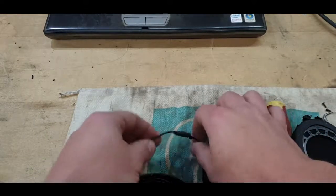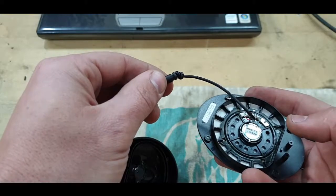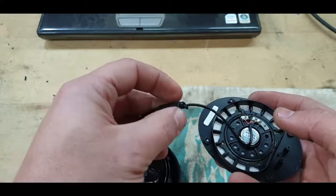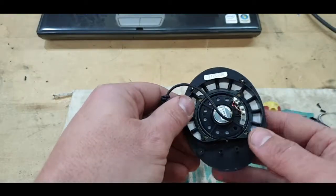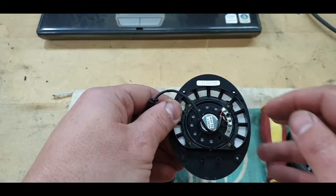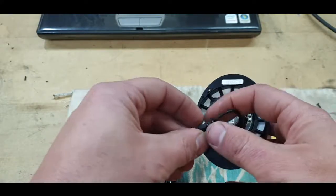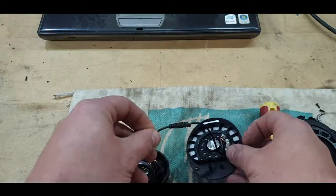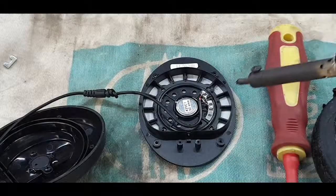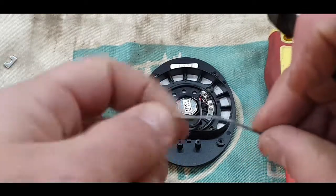Okay, basically this cable is quite tight in there. What I'm going to do anyways, I was going to cut the cable to get past the part that was broken, and then just resolder it there. So what I'm going to do is I'm going to loosen these with the soldering iron, loosen the solder, take out the cable, undo the knot, and then pull the cable out and see if I can push it back in once I've cut it. I have soldered wire like this before on smaller headphones, and it's very, very difficult to get them back on, so hopefully we'll get it done.